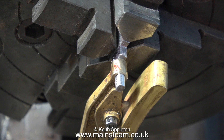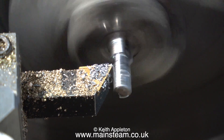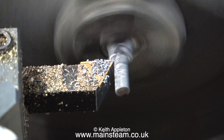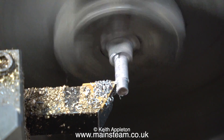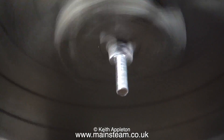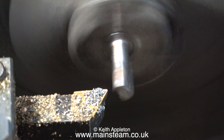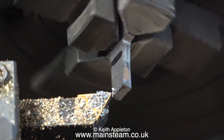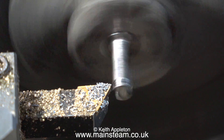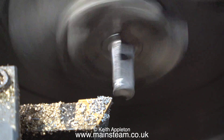It's not a massive problem though — don't forget these are dummy brakes so the functionality is unimportant. Once I've turned the end of all the brake beams I'm going to just touch them on the one-inch belt sander to create the illusion that they are perfectly round. These brake beams will be fully painted, and I will paint the ends as well, which will help to fill the gap in the oversized holes in the brake hangers. This cutting tool is very blunt and as it's bent the bar a couple of times it's probably slightly chipped, and it's not getting the best finish — but this is really not important. I don't need a bearing finish at all because once they're fitted to the locomotive they're never going to move. I'm making small adjustments to the position of the four-jaw chuck's jaws to make sure that I turn the part exactly in the centre of the bar.